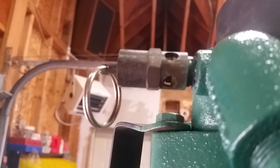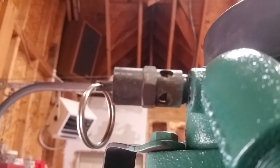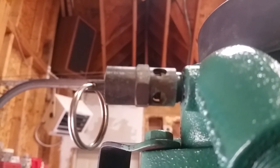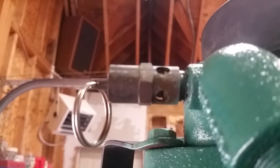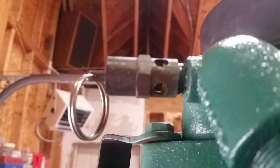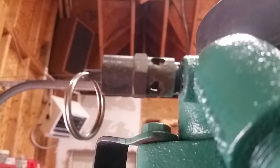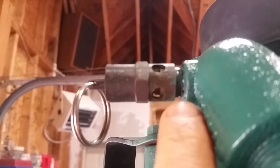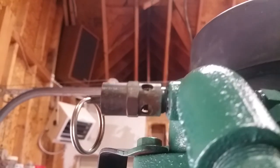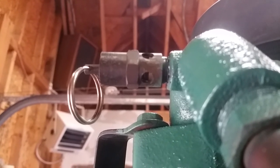Here's the pressure relief valve right here. It's just a little brass piece and it blows off once it reaches a certain pressure — it's a safety device so that if more air keeps getting pumped in there and something bad happens, the tank won't explode. Mine is 225 PSI when it opens; the one I got on order is 200 PSI. Watch your threads — this is a quarter-inch MPT thread; they make three-eighths and half-inch ones too, so make sure you get the right one. It's a really important safety device to have or else your tank would explode.